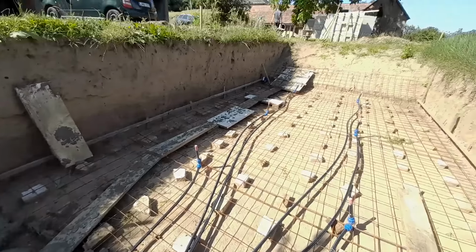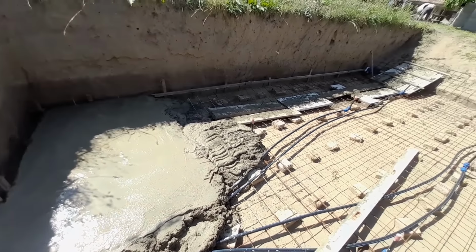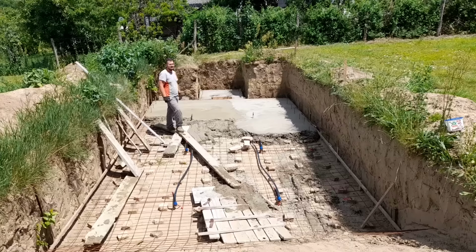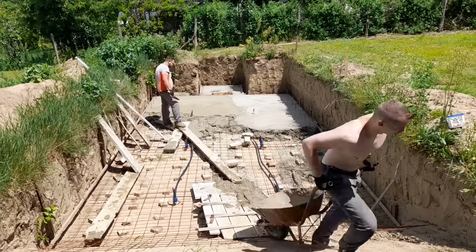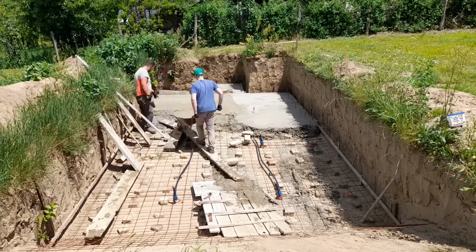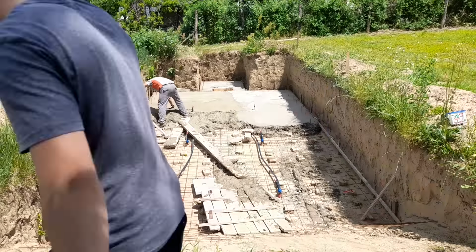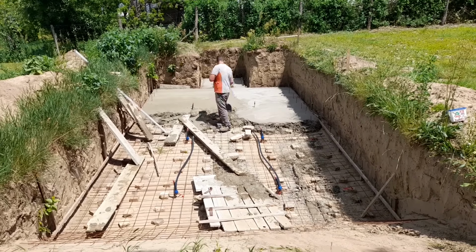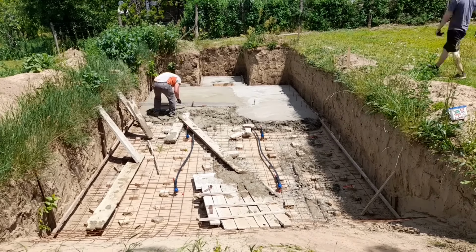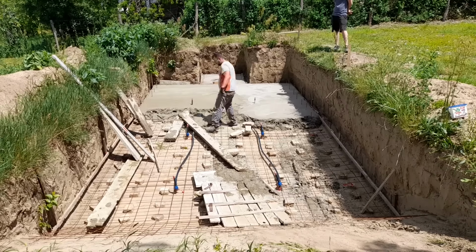I calculated that I needed around 8 cubic meters of cement for this, but I didn't realize that though I watched for the level of the planks, I didn't level the ground. So in some places it was 25 centimeters thick, in other places 35 centimeters. This cost me an extra 2 cubic meters of cement. But the most important thing, the bottom is now water level.